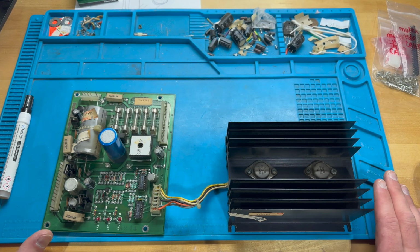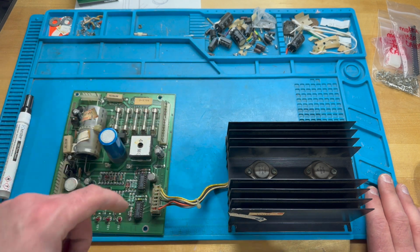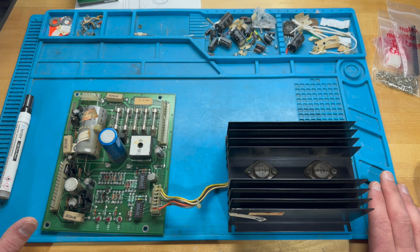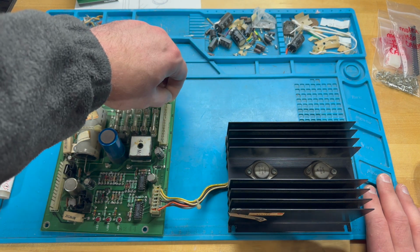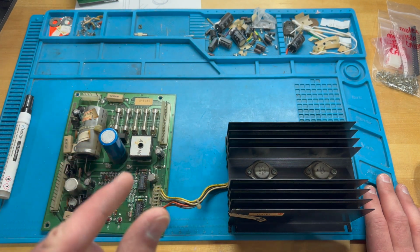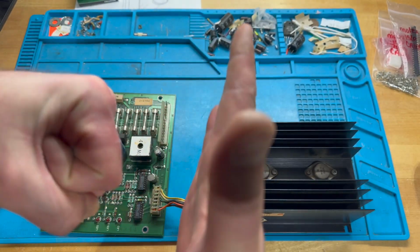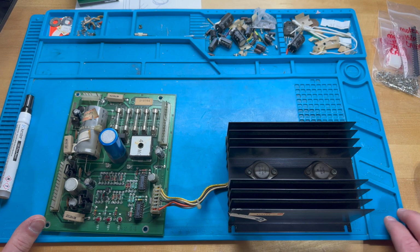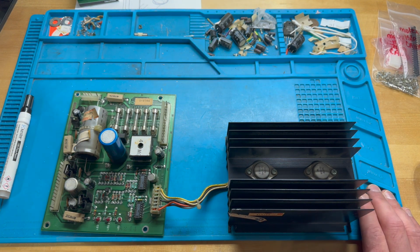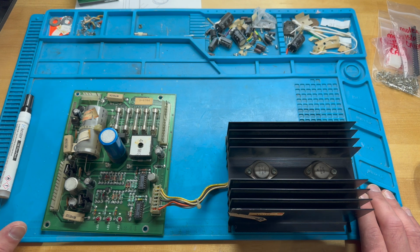The next thing I want to do is something that I've talked about before but never actually shown on the channel, and that's replace these old header pins and IDC connectors with some trifurcon stuff. So basically the original pins that Williams used, the original header pins, were round, and the connectors themselves have flat blades inside, and you have essentially a round pin making contact with a flat surface, maybe even two sides pinching it together. And it really wasn't a great connection, right? Imagine a ball hitting a flat surface. So you often end up building resistance. The connection gets corroded, builds up resistance, and can burn things up.